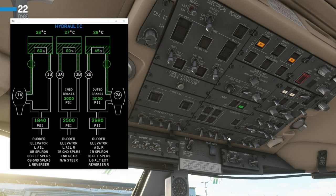We're then going to turn these three switches to auto, and you can see pressure is then lost. We'll then turn the hydraulic 3A system on — this only has an on/off position and is an electrically powered hydraulic pump. We're going to use that while we're on the ground. The other three are on auto, so they will come on automatically as needed later on.